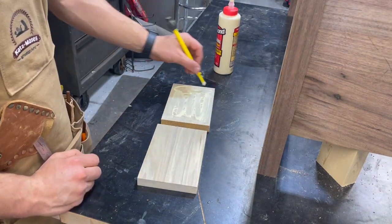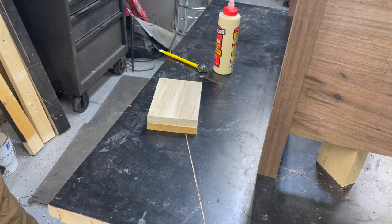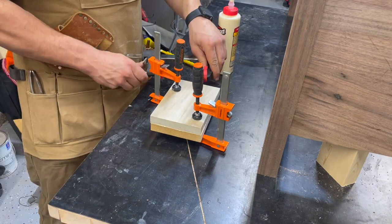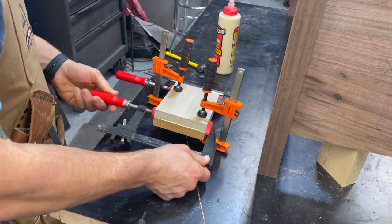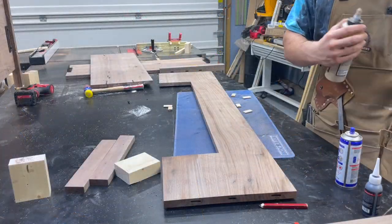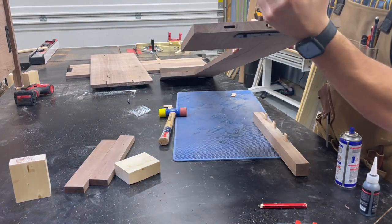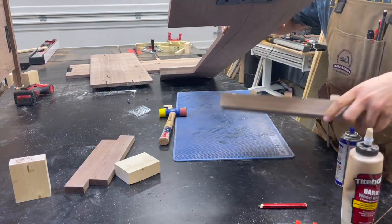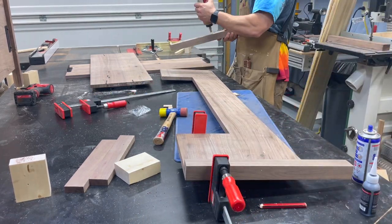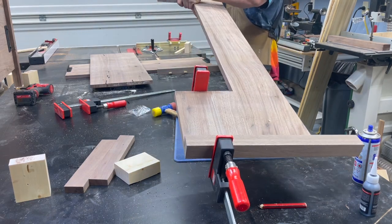Now, to hold the slats up and everything, we're gonna be using some poplar, and then we're also gonna be using our center rail. So for the center rail supports, we're gonna be laminating these two chunks of four-quarter poplar that I had sitting around. This is exactly how I did the leg blanks, since that footage was lost. Smeared the glue, and then a face grain to face grain joint, which is one of the strongest. After that, some more chocolate milk, some more dominoes, and a little bit of clamping just to get the head and footboard all finished up there.